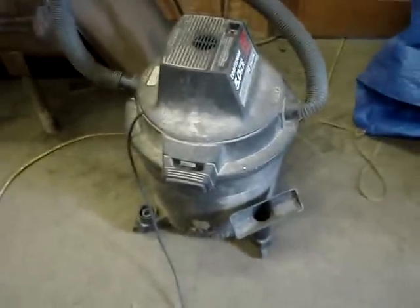Then we have a shop vac hooked up to ours. This side here is vacuum, so that hose goes to this spot right here and that sucks the dust out of your air in there so it helps you see better. Then this one is blowing air out, so that one comes in here and it goes in above that light — right through that hole. When you have this piece of plexiglass here it blows the air out in front of that light to keep it clean up there, and it blows it down across your window so that it helps you see better there.